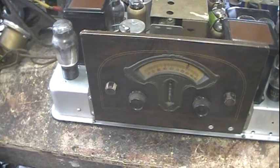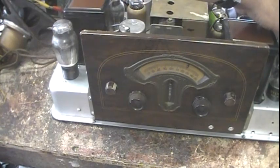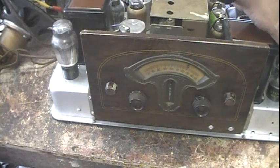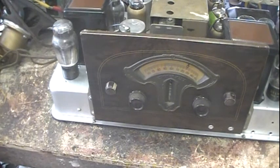I think that's about all I've got to say about it, so you can kind of consider this the finale. I kind of wanted to get it cleaned up and I did shine a lot of stuff up on it — more or less because without a cabinet it's just going to sit out and be something to look at. That's all I'll probably do. Now it's supposed to have 83 rectifiers — I only got two, which are actually my tube tester's — it came with 83-V's, which are slightly different, they don't have any gas in them. The 83's will glow — I need to buy a couple of 83's to put in here. So that when it's on, at least you get that piece of eye candy of them glowing a little blue. It would be a nice little radio to operate in the dark, with low lighting.